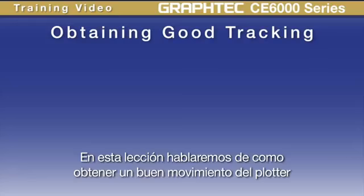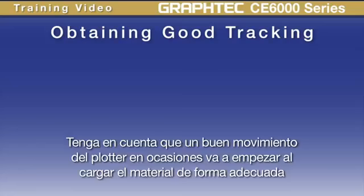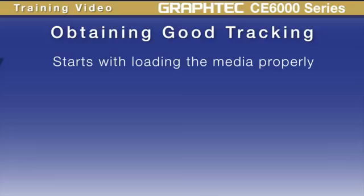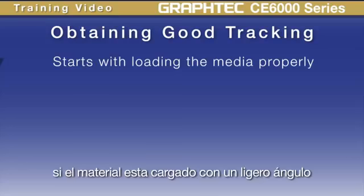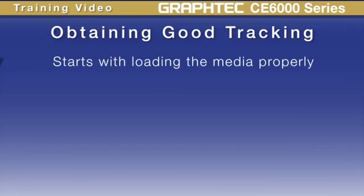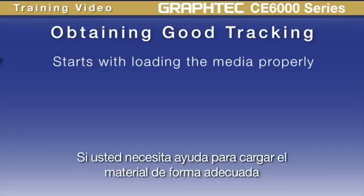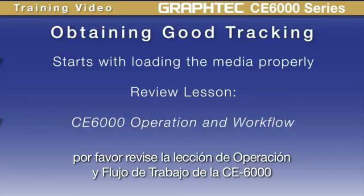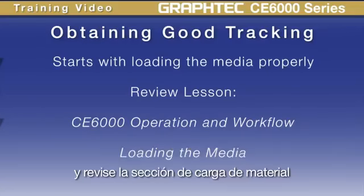In this lesson, we'll cover how to get good tracking from your cutter. Keep in mind that good tracking will often start with loading the media properly. If the loaded media is at a slight angle, this can cause skewing over longer jobs of 5 feet or more. If you need help with loading the media properly, please review the lesson on CE6000 operation and workflow and review the section on loading the media.